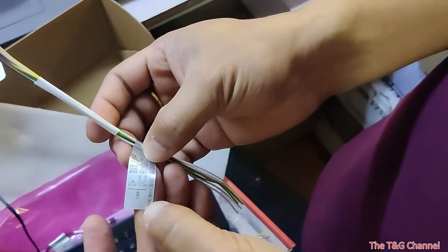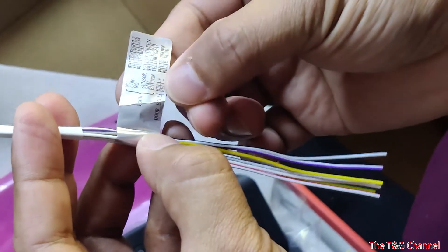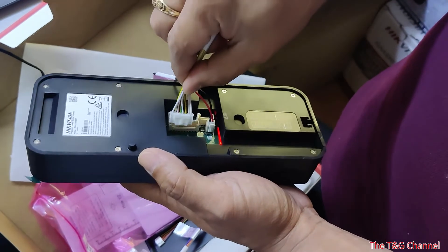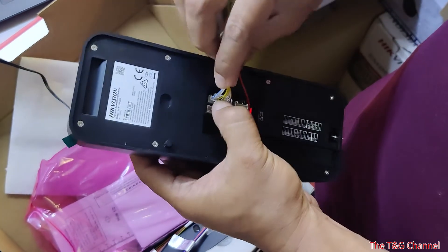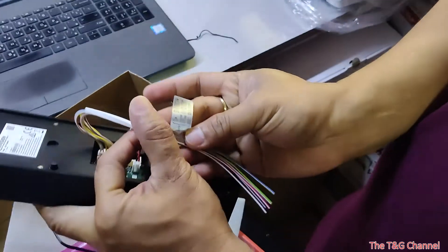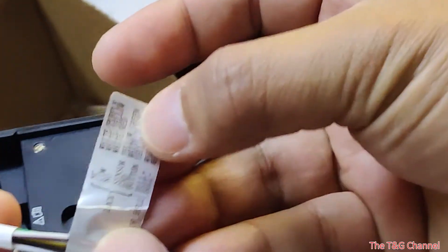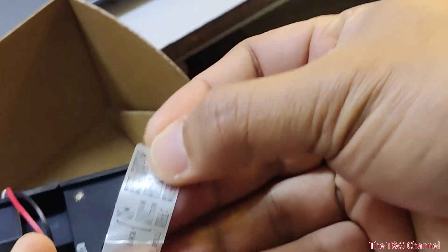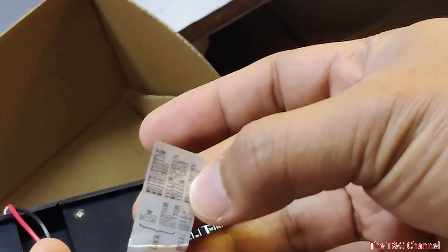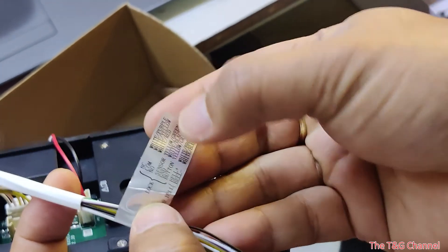For your lock connection, you will see here: lock, lock, doorbell. This is the cable used for the lock — you will not be confused because it will only fit according to its size. You have to follow the color coding: for sensor, for exit button, for lock. If your lock is normally closed, there is white-purple; for normally open, there is white-red. For the exit button, follow yellow-gray and yellow-black, and white-black. Follow this color coding.